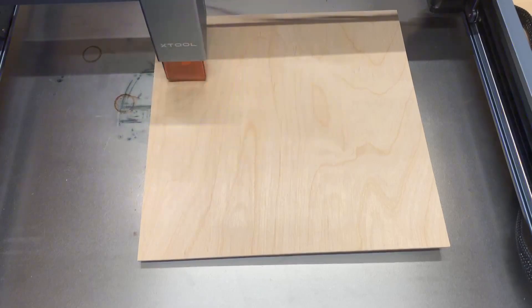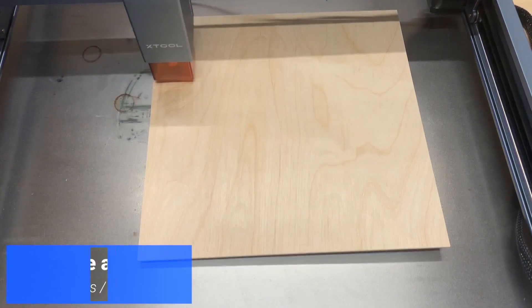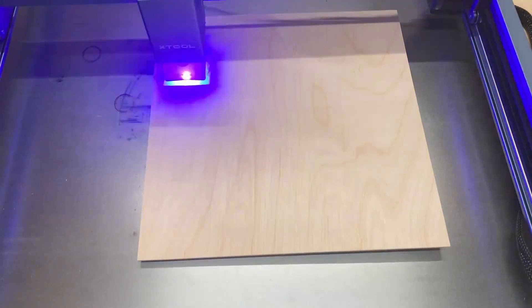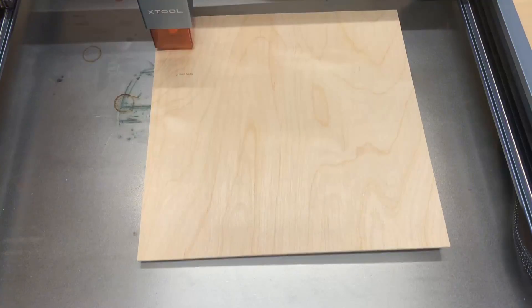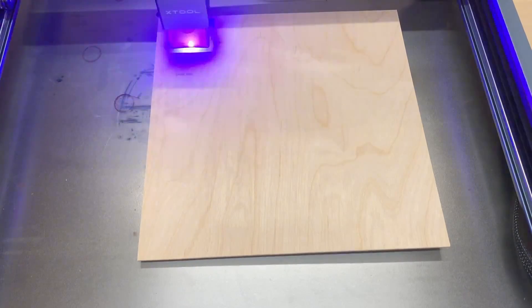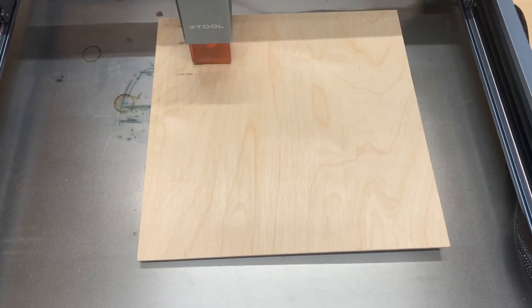What you're seeing here is actual speed for an engraving, just to give you an idea of how fast the machine moves during operation. I want to talk about one of the drawbacks of this machine. At this price point you would expect a machine to have end stops, and this one does not have them. End stops allow for repeatability, which is really useful if you're going to cut five or six of something — it lets you know where you are in the XY coordinate space. The nice thing is it does have a targeting laser, and it also has framing features to place your image on your stock. But it does not have end stops, and I hadn't seen other videos mention that, so I wanted you to know.